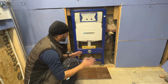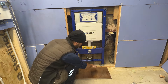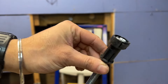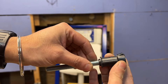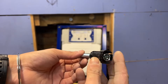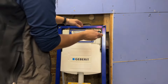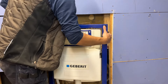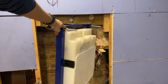I'm happy with the top — I've got a solid fixing to go into. I know there's a solid fixing here at the back. I've set the height of the frame. These rods have non-return catches, so I'm going to push them through the holes. These are the rods that go into the top of the frame — push them in and they snap in. That's snapped in, and if you look at the back you can clearly see the rods sticking out.